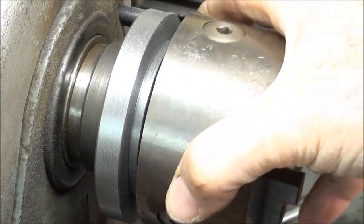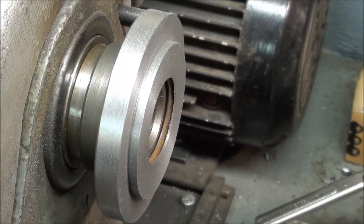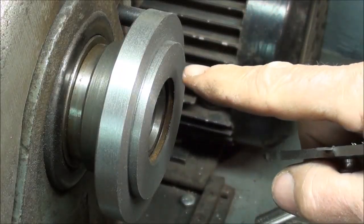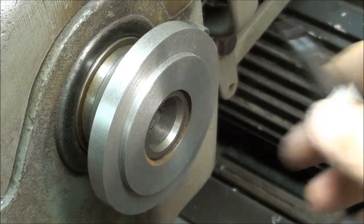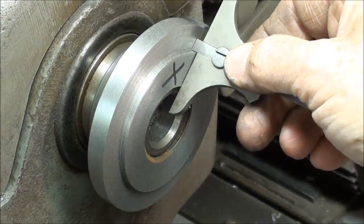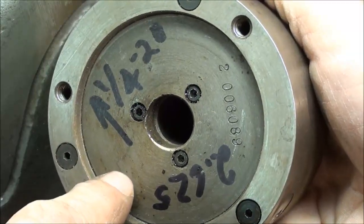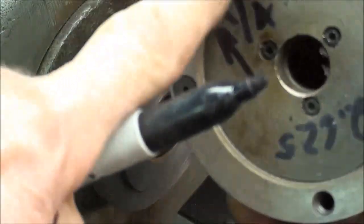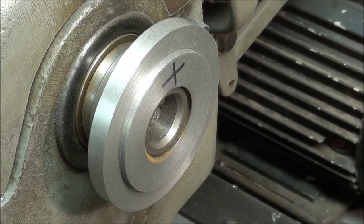I am now at the right diameter but I am a little bit too long right here, so I'm going to take off about 20 thousandths — face off about 20 thousandths — and then I am at my diameter and depth and I'm done on the lathe. I have faced off this surface. I don't want this X-marked surface to touch the bottom — it isn't necessary. The registration will be done by this diameter that I turned, and this surface here will rest up against this surface. The X surface is irrelevant, and now I'm going to take it off the lathe and go to the bench.